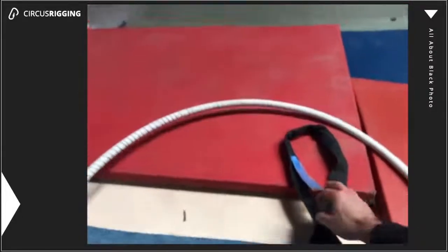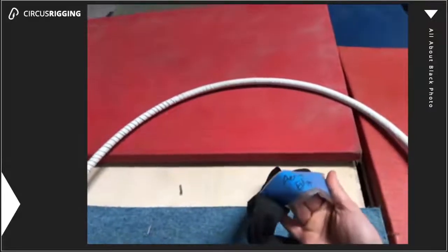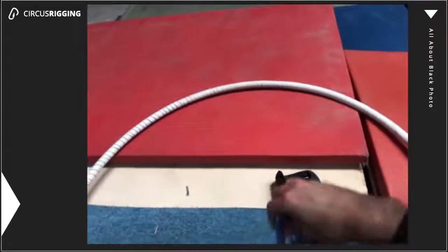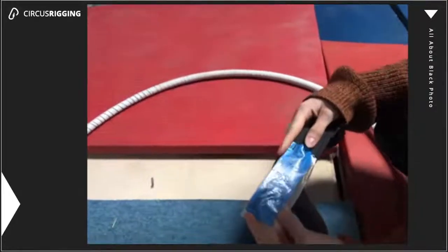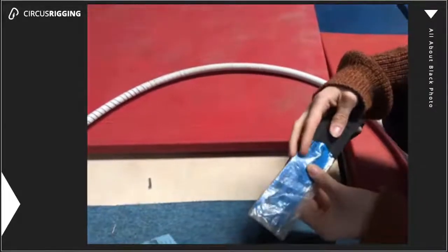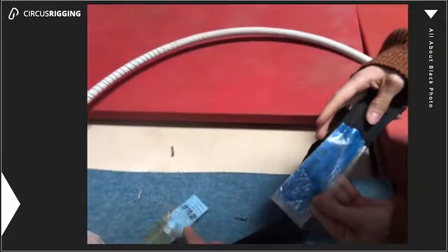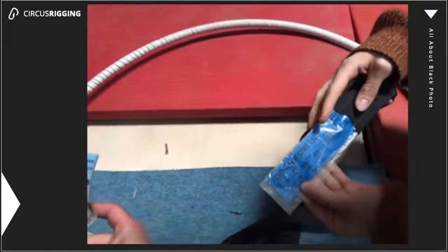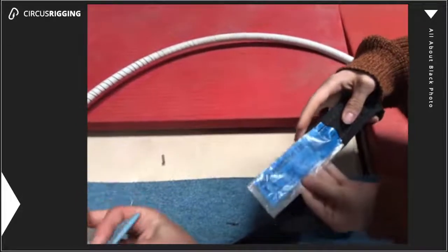Would you just base it on all the criteria that we've currently covered? I know that some manufacturers recommend that they retire their round slings after 7 years. Given the use that we're putting them to, and the cost, if they cost £1,000 each, it might be slightly different. But in the case of aerial work, it's obviously critical.